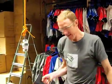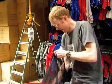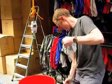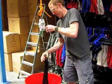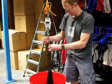This is how you test flotation of a life jacket. We've got a 10 kilogram steel weight and a mesh bag. We're going to weigh the weight in water, because of the density of the steel it weighs considerably less in water than in air.